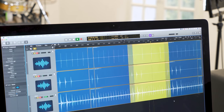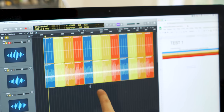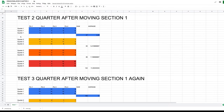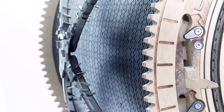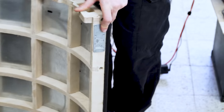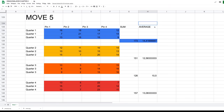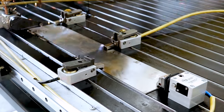The different number of snare drum hits makes it very obvious in the waveform which programming section is which, so I could divide the sections up, color code them, and measure all the latencies and enter the values into my Dragon Slayer Chapter 2 spreadsheet. I calculated the average of all hits to know exactly how much I should shift a programming section back and forth. To adjust the position of a programming section I can change the number of shim washers under the touching bolt. The shim washers are 0.1mm thin, so in theory I should be able to slide the programming sections in 0.1mm increments.